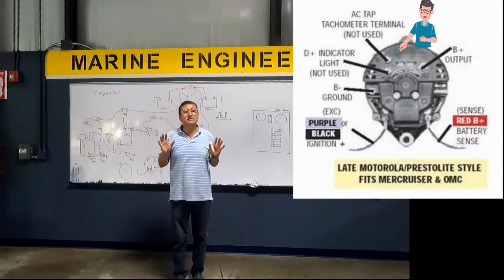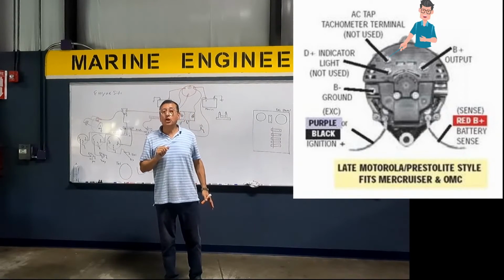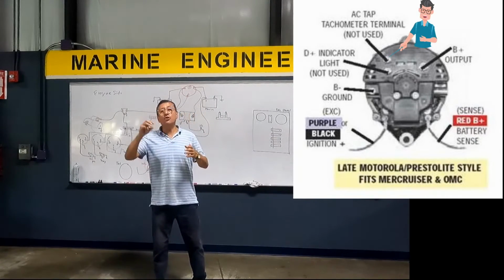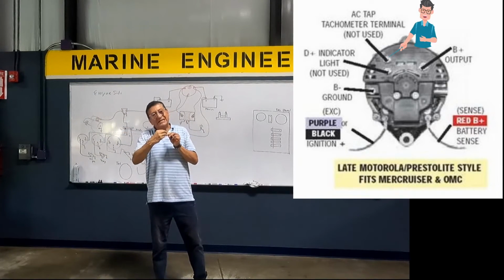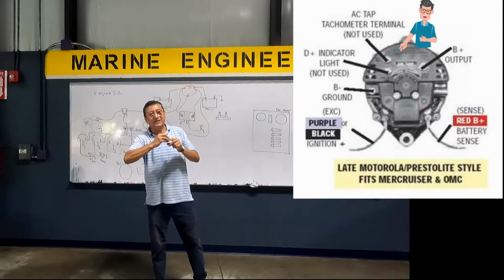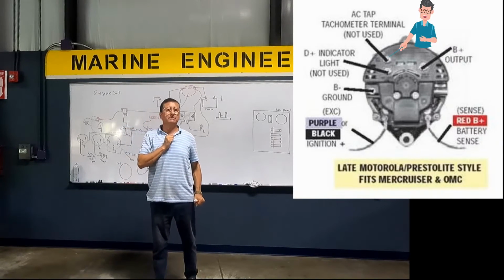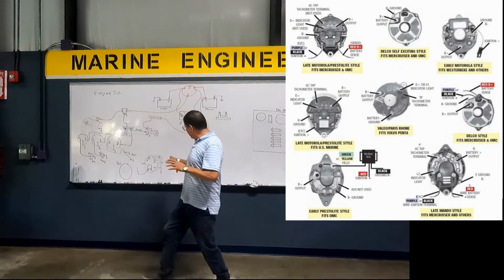Because in some cases the alternator is working with signal coming from the ignition switch, the ignition distributor. In other cases, the signal is coming from another sensor in the flywheel. For that reason, that terminal is covered with plastic. If you need to remove the plastic, it's not easy. And finally connect the gray cable and protect again with plastic, because it's AC signal. Anybody follow me? Mr. Lopez, my alternator is not like this.